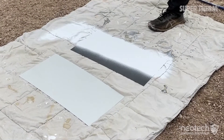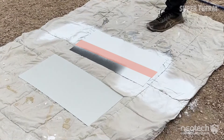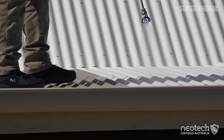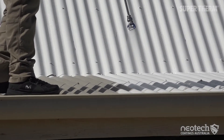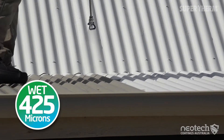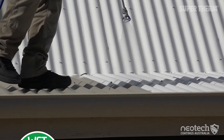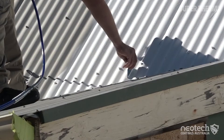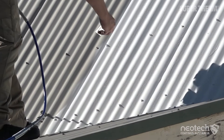You can see on the second pass where the airless has created a ridge with two coats, while either side is just the one coat. To ensure that the application of Super Therm is consistent with airless spraying, have a 50% overlap across the entire substrate. This should give you the correct 425 microns wet thickness, assuming the fan tip and pressure from the pump is all consistent.